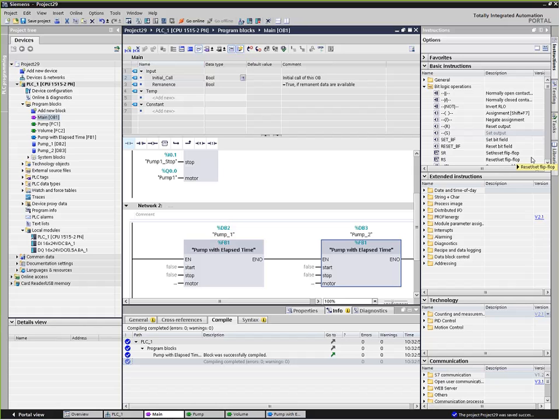One of the attributes of the TIA portal is its efficiency in programming. One of the things that I've found attractive about Siemens over the years is this concept of structured programming and subroutines has been with us for many, many years. And something that if I was doing a plant that had 20 exactly duplicated machines in it, or even somewhat close, we could actually write code for one of them and then call that code several times. And effectively what we're doing is leveraging our engineering efforts so that we can actually reuse code and not have to start every project like we're reinventing the wheel.